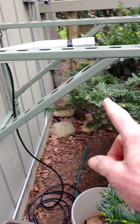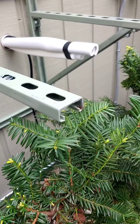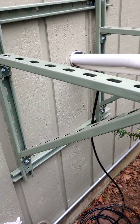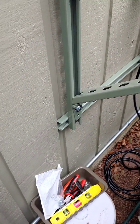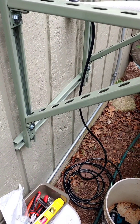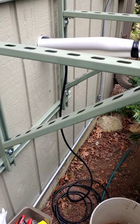I put a strut underneath to strengthen it up. This is standard unistrut — the half-thickness stuff, not the one-and-five-eighths stuff. I used strap hinges here and down here because I didn't want to mess around heating an angle and bending it. Strap hinges are plenty strong.